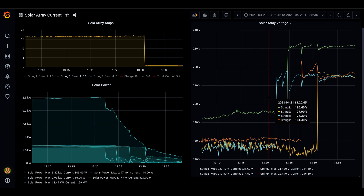The string with the highest voltage is the first 12 panels. At full output, this was about 196 volts, and the lowest string was string 3 at about 174 volts when outputting max power. That max today was reached around 1:30, right at peak sun, when the battery got fully charged. After the amps drop and the need for power from the charge controller drops, the voltages go up — the highest was 232.8 volts.